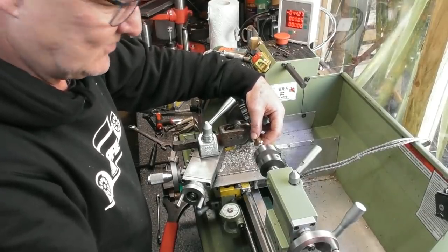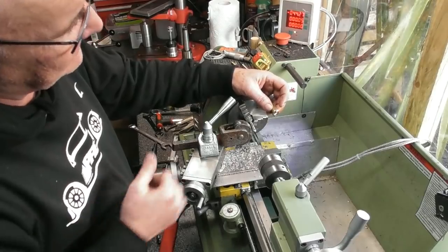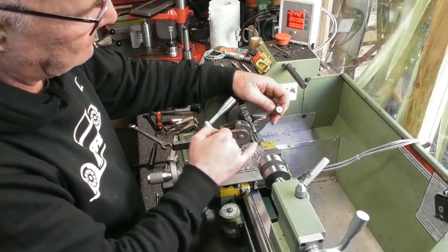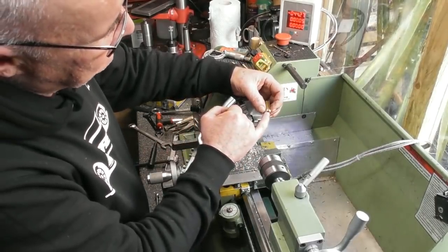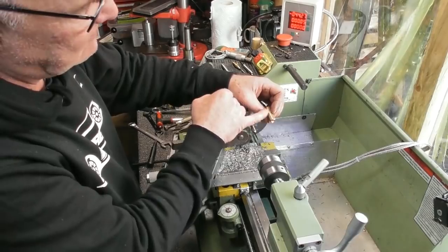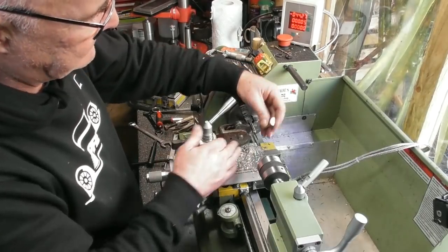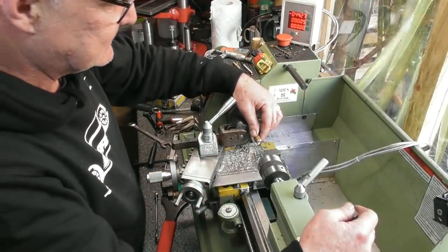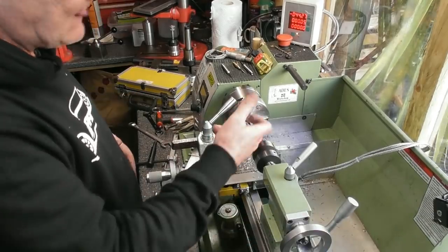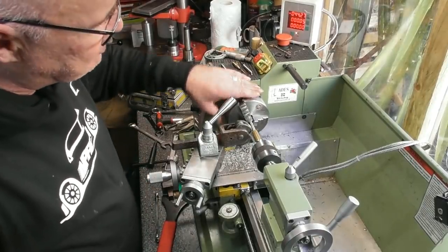I lost a bit of footage so I'll retell you. I made up a piece of half-inch diameter brass — faced one end, centre drilled it, drilled it right through, two thou clearance, ending up as a 2.4mm hole to clear the point, and centred the other end. It was running lovely and true, done in the collet. I've got a 12-13mm collet so a half-inch fits lovely. I've got a nice big taper in there which picks up on the ball end at the front. The point goes inside and the centre goes this end to locate the dart, giving support away from the chuck. I've changed back to a three-jaw chuck for a bit more rigidity.